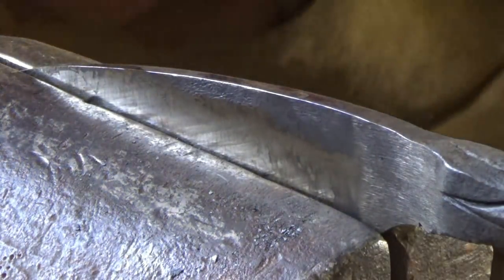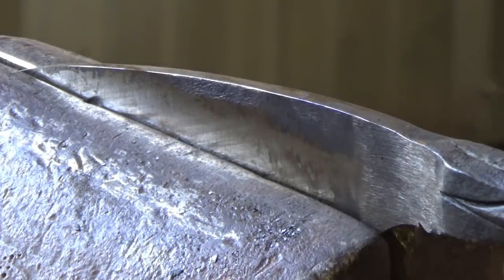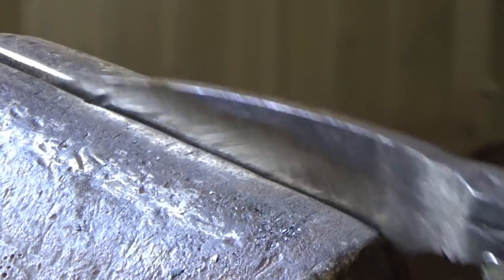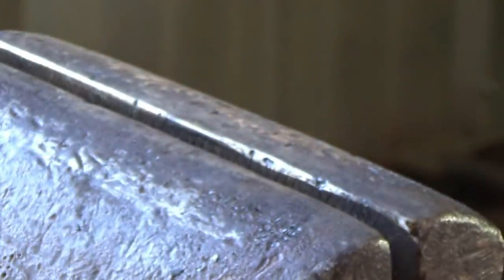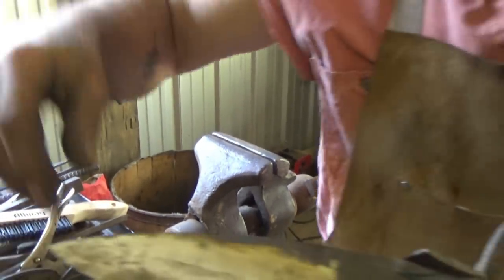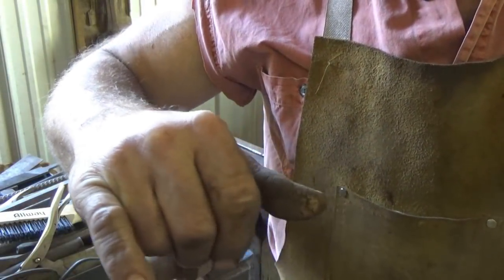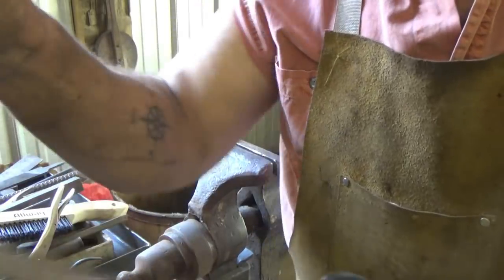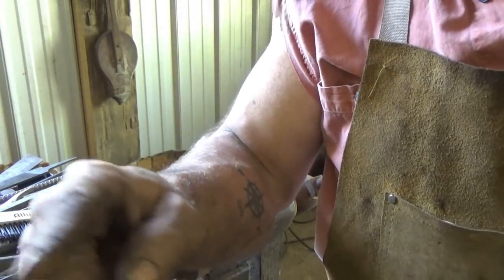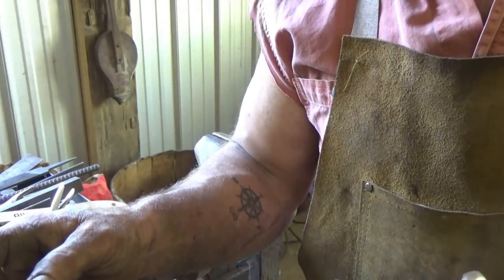Remember, she's a railroad spike, so it doesn't take much to get her somewhere. Let's see what we got. Well, you can see the colors in there, right? I'm actually not too disappointed in it. All right, so we've definitely got dark purple here. I still got to get some browns going down towards the bottom. All right, some straw, actually, is what I'm at right now.